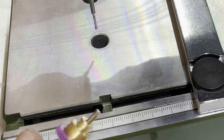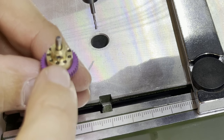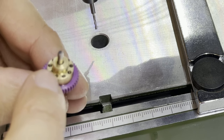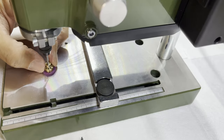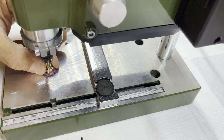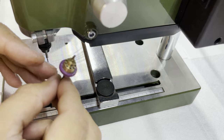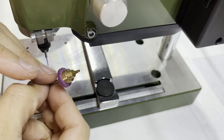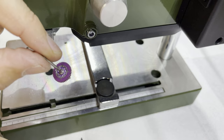In my pillar drill I have a 1.2mm PCB drill, and I'm going to go around and drill through the gear at every one of these points — that's nine holes around the gear. So that's gone through — a little bit of aluminium dust and swarf — and I've gone through the gear.